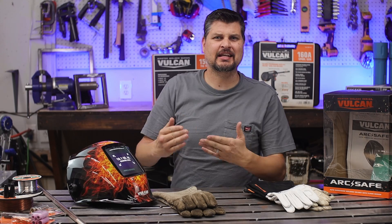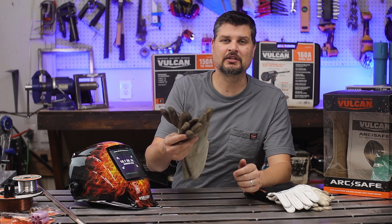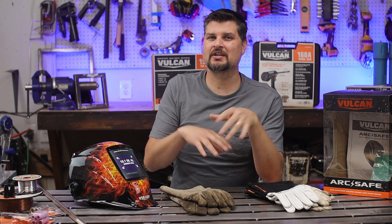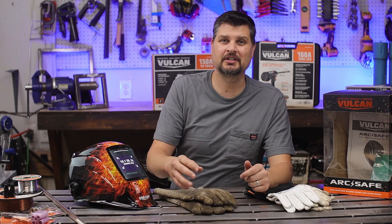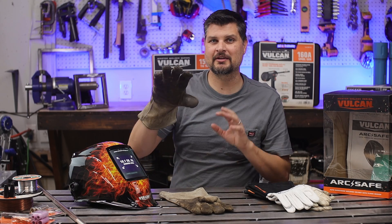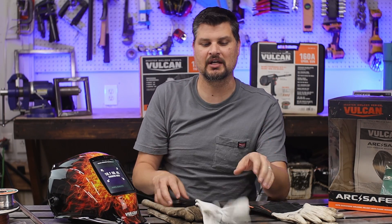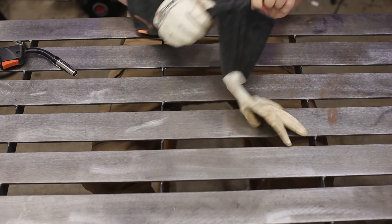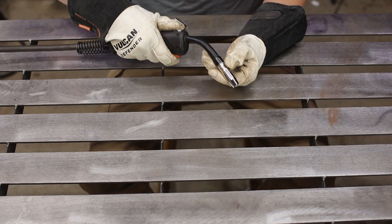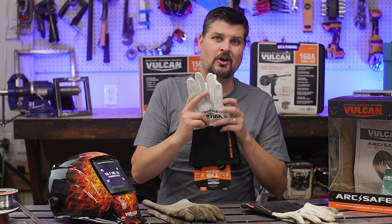Safety first — except I put it as the second item. Let's start off with the gloves. These are just the cheap, bare-bones MIG welding gloves. Vulcan does have a black pair of gloves for about $25, but I've got so many pairs I didn't bother. I usually go with the cheaper three-pack, and I always throw an extra pair in with my Dutch oven type stuff. I do really enjoy the TIG welding gloves — they're just a thinner leather, so you've got a lot more dexterity. I've actually started using them more with MIG welding on lower settings, so as long as your metal doesn't get super hot, these are perfect.